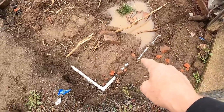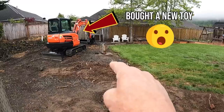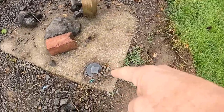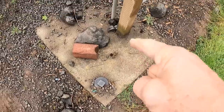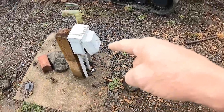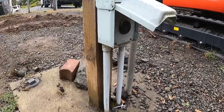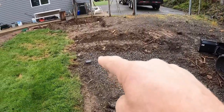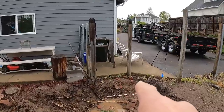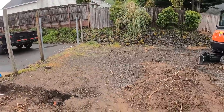These are the lines that we uncovered two or three days ago before the rain just cut loose and we had Mother's Day weekend. Right over here is a little pad that has the utilities that were in place for the RV parking. We have the sewer inlet, a potable water hydrant, and 120 volt - actually it looks like it's 240. Should be 240 but it didn't test at that. So we've got to discover how these things route back to the house, take out this piece of sidewalk in order to tie it in with what's going to happen around the shop, and find a new way in for a better electrical feed, more dependable water, and make sure that the sewer line is going to work.